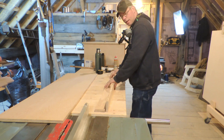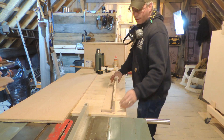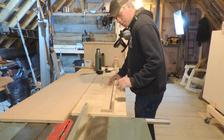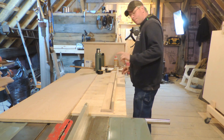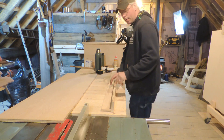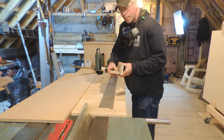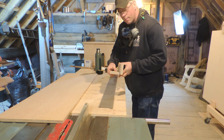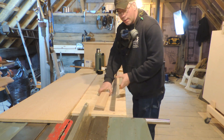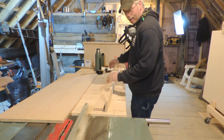I don't want to start with my fence like this — I'd rather have it down here and make this base a little longer. That's just how I prefer it, but that doesn't mean you have to do it that way. So what I do to put this together is I glue it and I put pocket screws in. But you want to clamp it really well, because what happens with the pocket screws — it will actually push that piece down. I'm exaggerating this so you guys can get the idea. On a router table, a slight bow is not a big deal.